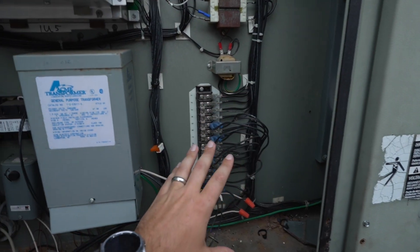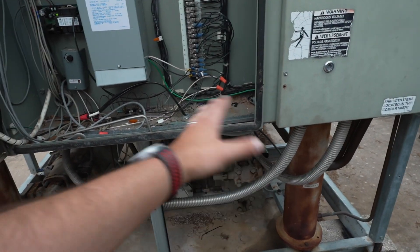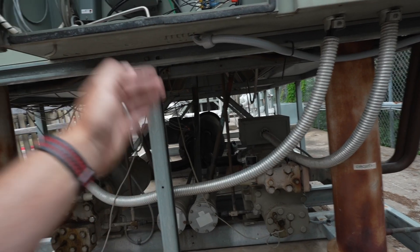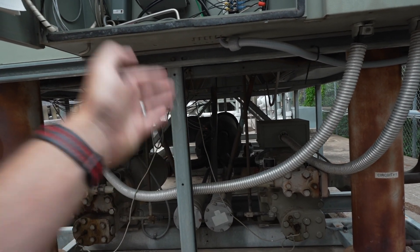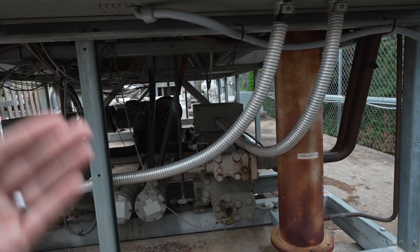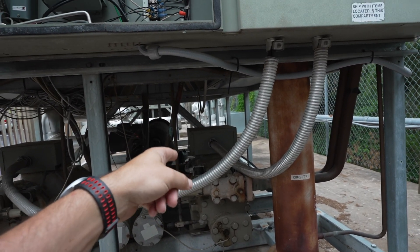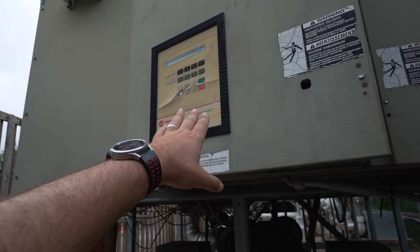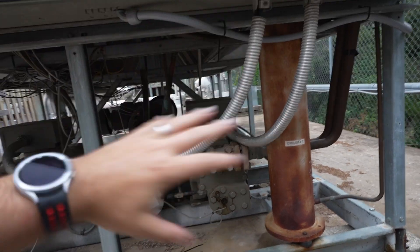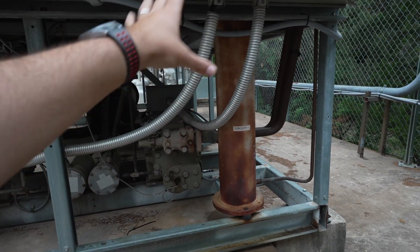Ultimately, somebody at some point — I don't know why — had moved that wire to terminal eight in order to apply constant power to the female unloader. It doesn't really matter why; ultimately it wasn't correct. That was my main issue for startup. When we have this issue, a lot of times it can indicate the EEV is having trouble not stroking right, a sensor issue on the saturation or suction temperature sensor, or the slide valve isn't fully sliding back to unload the compressor. One thing I didn't note was that at startup with that female solenoid de-energized, we were able to get 42% on our compressor, which was a major improvement off of 50% — so that explains why I wasn't seeing us get below 50. In that process, we also found our oil issue and were able to get both resolved.